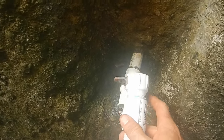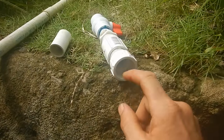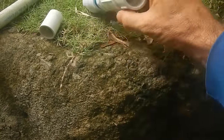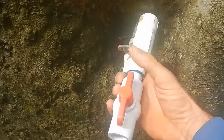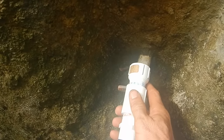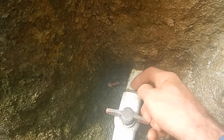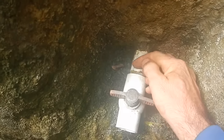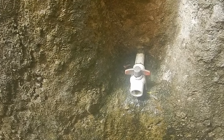So what I'm thinking is I stick this on the pipe just far enough that it's airtight, right? And I should still be able to stick it further on past the point where it's watertight. And if I leave the thing open, it won't have any water pressure. So it'll just have to be watertight with no pressure. So I get it on as far as I need to so no water's leaking out here. And then I put the glue around there and get it in as good as I can, then shove the thing the rest of the way on. And then if I'm lucky, half of it will be glued, which will be enough. Totally enough. And Bob's your...